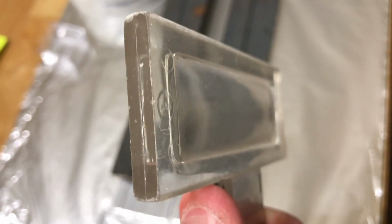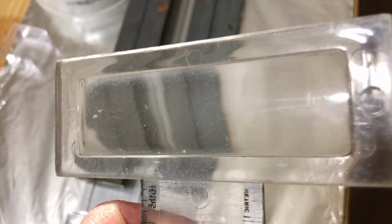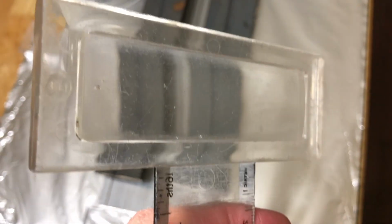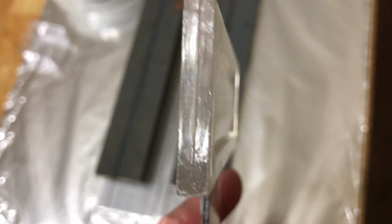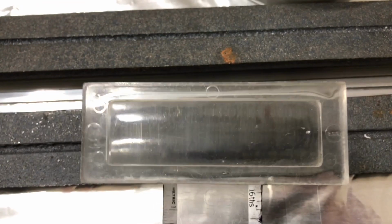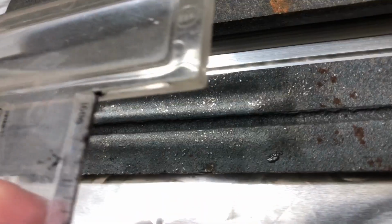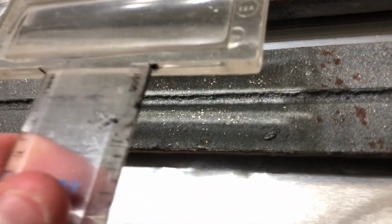This little ruler right here has a lens like that on it, but both sides are curved out. Both sides instead of one side. But it's a lens that's shaped basically like a rectangle rather than being round. And the curved side is long or horizontal, if you will, rather than actually being round like a regular lens. And so what it does, it focuses light to a line. And so, of course, this one's designed to read with. If you look at the room lighting, look at that little line it creates on that dark surface. It focuses the light to a line instead of a round spot.